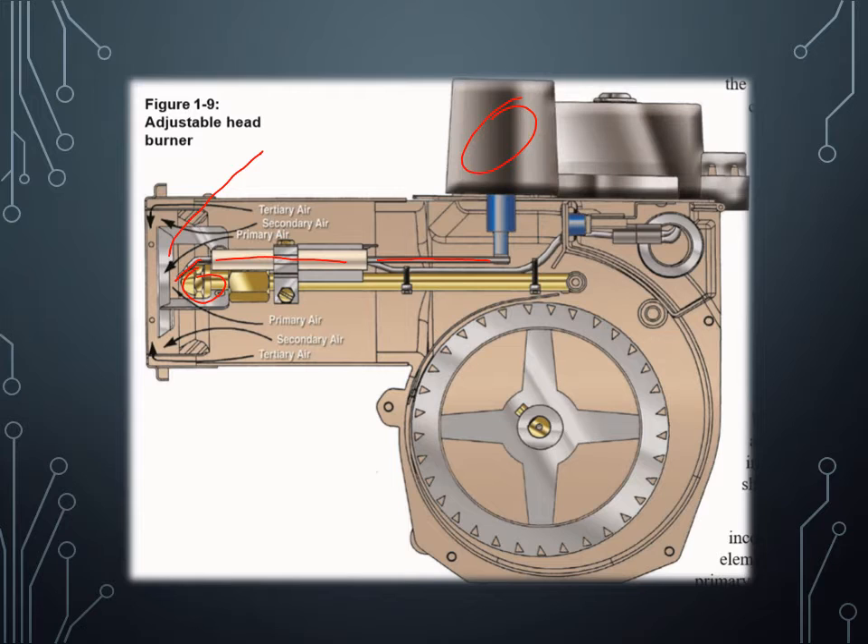The electrodes go all the way into the holder, and we want to make sure they're not touching any part of the air tube. This is my nozzle, electrodes here, and this is my turbulator or diffuser plate. Coming from here is the cad cell — this is the component that enables the control to detect whether there's light inside the tube. It should have good visibility of the flame or the light coming from the chamber. This is the squirrel cage fan — it turns via the motor, and there's a coupling that goes all the way to the pump on the other side. To remove the squirrel cage fan, there's an allen key screwdriver we loosen and take out.